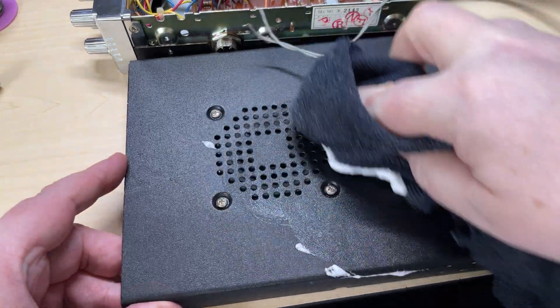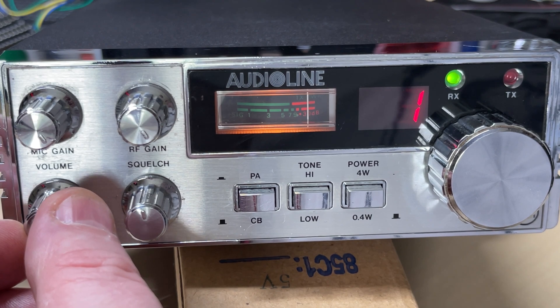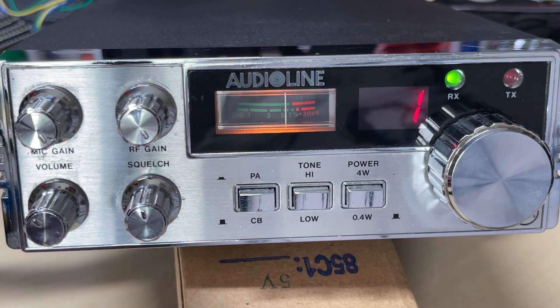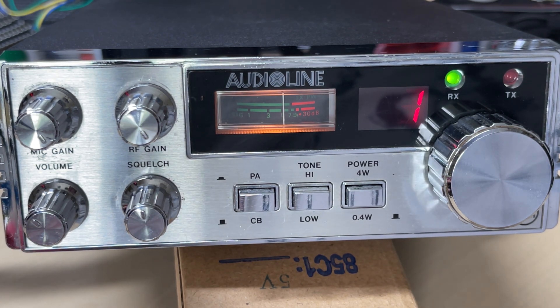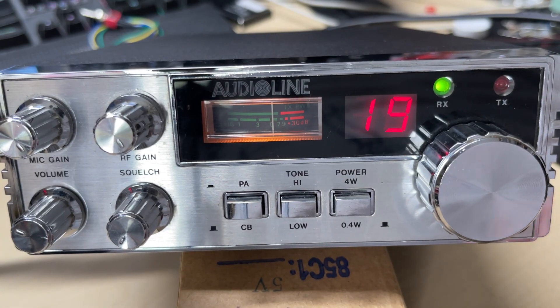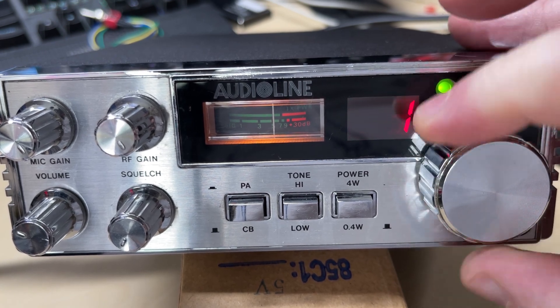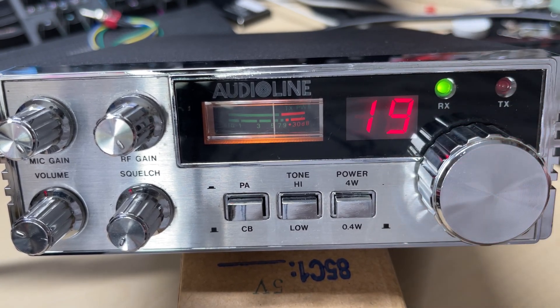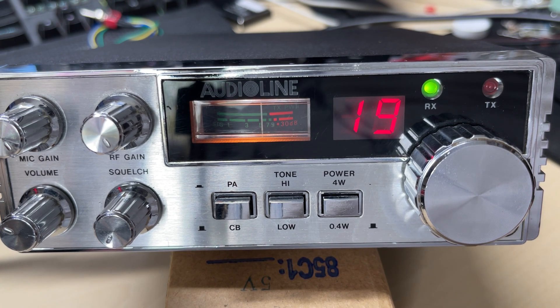As always with Microchips stuff, a little going over with foam cleaner. Excellent — so everything's working nicely. There we have it: a nice quick repair, and yes, the curse of the 10-volt capacitors, which seems to plague these Uniden chassis — no matter which chassis it is, they all seem to play up. Anyway, hope you like this quick video. Don't forget to like, subscribe, join the Facebook group, buy me a coffee, join Patreon — and thanks for watching, we'll see you in the next video.